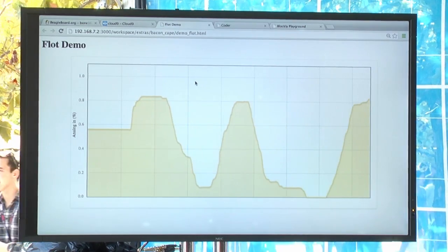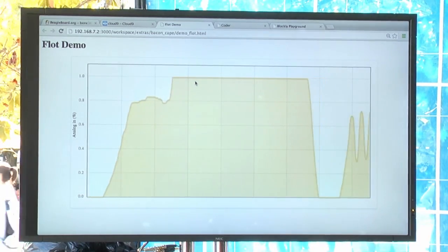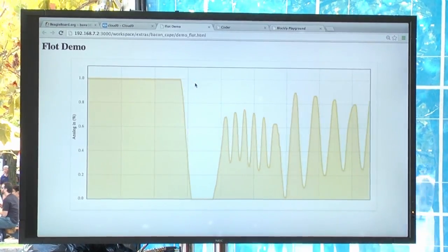Not a lot of magic going on here. If I push the slider down it goes to zero, and you can see it's very responsive to me. It just ships with a JavaScript library that I can embed into any web page, and it communicates with the ADC converters on the board, with the digital signals, and with the pulse-width modulators — so I could do things like motor control. You can see people like OpenROV building underwater exploration submarines, hooking up webcams and streaming video back. That's a bit more advanced — I just wanted to show you the really quick simple stuff. This is straight HTML and JavaScript, and I'll go through the code, but I want to get through the demos first.